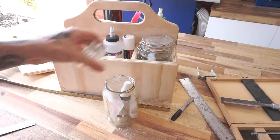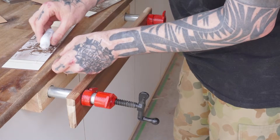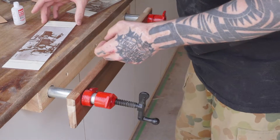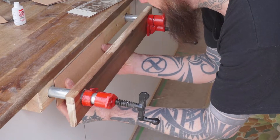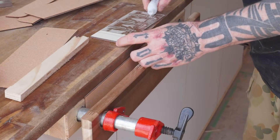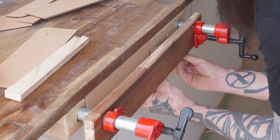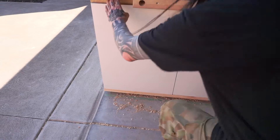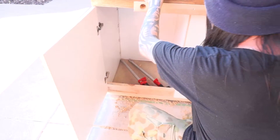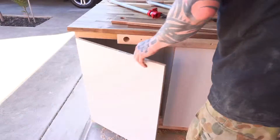I made this glue caddy for all the glues and accelerators that I use most. If you want the CNC files or plans to make your own, drop me a comment below and I can cover it in a future episode. This part is easy — pour glue on and stick them to the wood. Because I've set my clamps to open to around 55mm, I need to use shims between the jaws of the vice and the faceboard. A truly smart person would have glued the cork onto the spacer block and faceboard before the vice was mounted. You could also cover the entire spacer block's face with cork and cut out your holes carefully afterward.